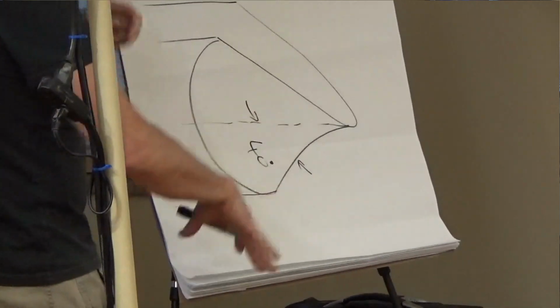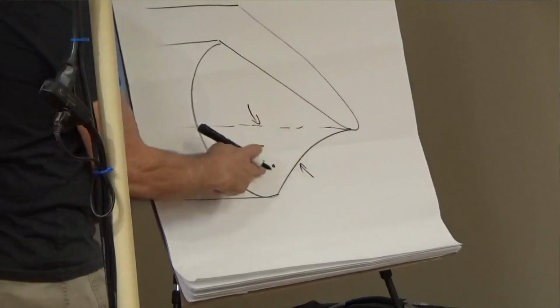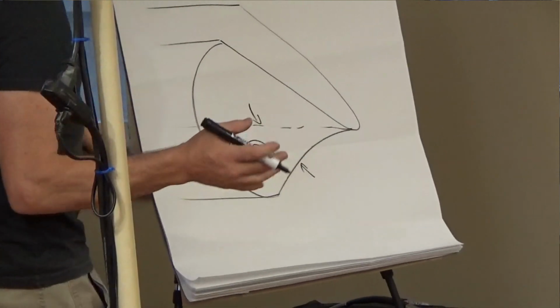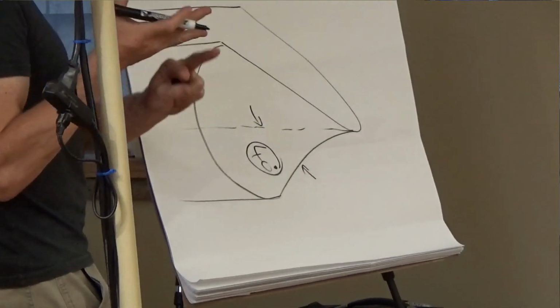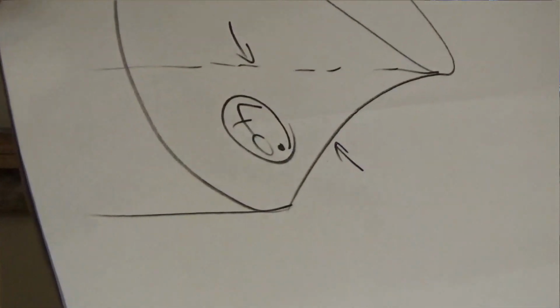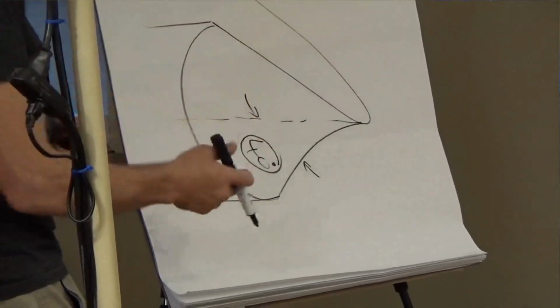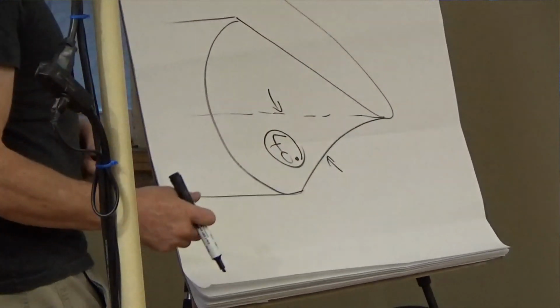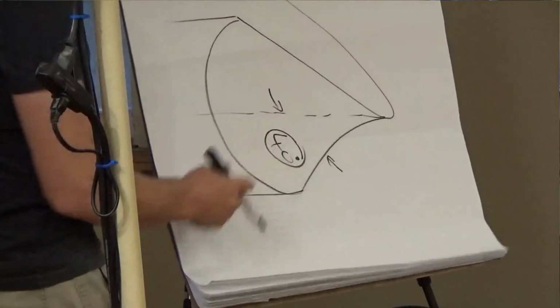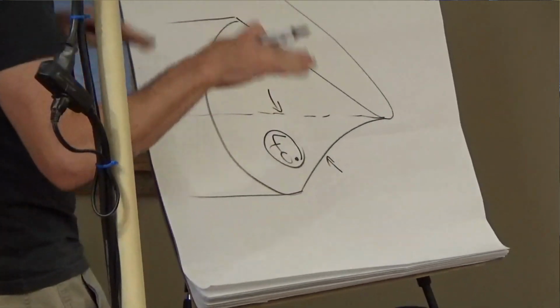So when you go up or below on that, it starts to react differently to each of the different woods. 40 is the angle that works for every species, even spalted, right up to super exotic. We tried that today, we were turning some punky wood, rotten punky, and you could still cut it clean with 40. And then you could take a piece of honey locust, which is pretty dense, and cut it with 40. And then you could take a piece of cocobolo and cut it with 40. Once you go above and beyond by several degrees, it starts to change.